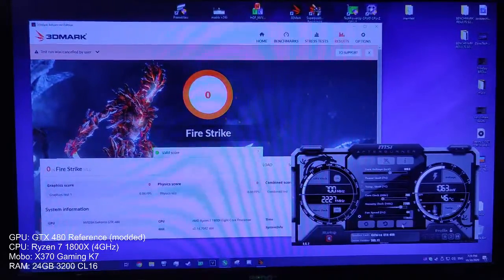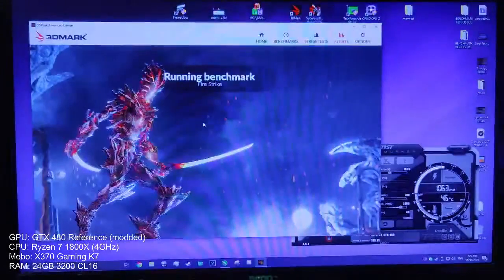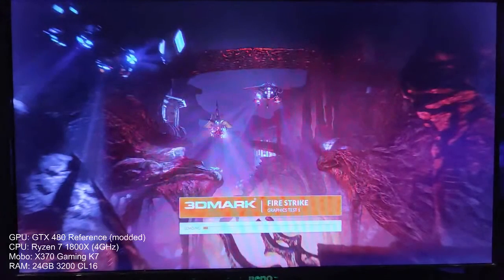Let's just try 2200 again. Maybe it's like a memory strap thing. But yeah, I'm really surprised that this is still artifacting and crashing even. Because on the 460 the memory got like 100 megahertz extra from the Volt mod. But maybe the cap mod already took care of the voltage situation.